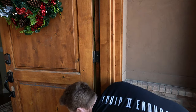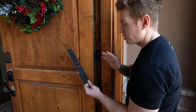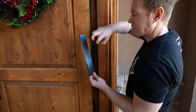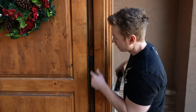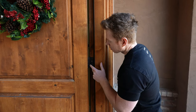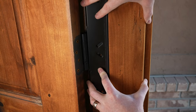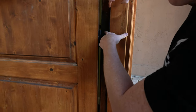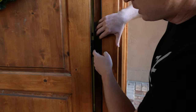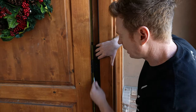Now put the actual hinge shield on. This is how it works. Remember the jam shield — basically what it does is it extends the strength of it by locking into more of the actual jam. So we've got two three-and-a-quarter inch screws that are anchoring the hinge into the jam right now. The hinge shield covers that. We're gonna put two more of those screws and then two more through here that are also going through the actual hinge.